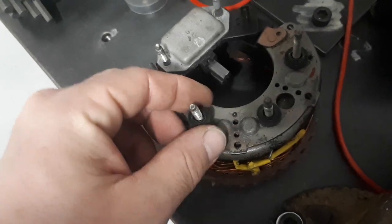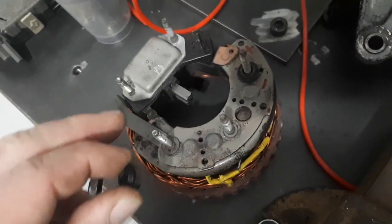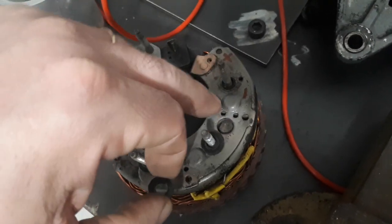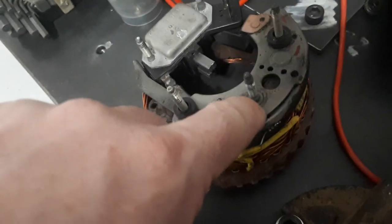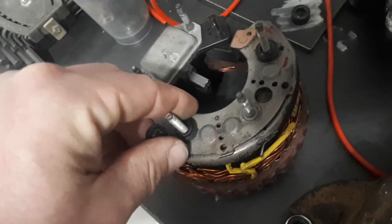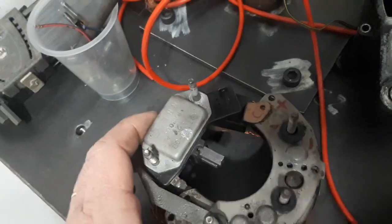You can see here on the bridge — you do need those two insulators to work as spacers to keep the bridge in the correct position. This is the positive terminal — you can see it's insulated — and this is the negative side of the bridge. You can double check that the negative side of the plate is mechanically connected to the screw via a kind of spline that indents into the plate. The position of the new hole I'm going to drill will be about here, with plenty of clearance so it doesn't touch anything.